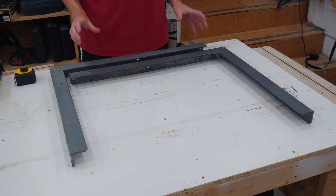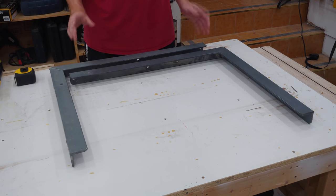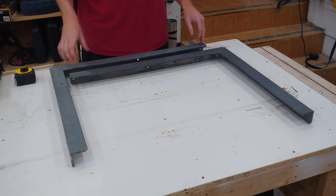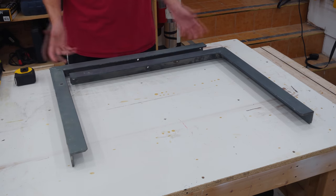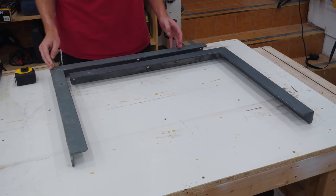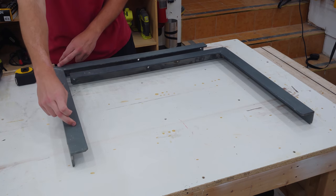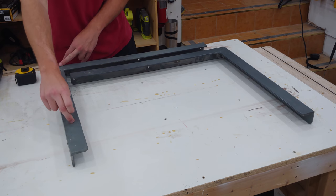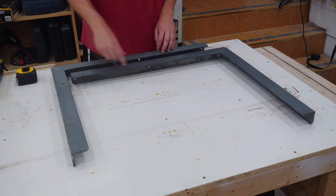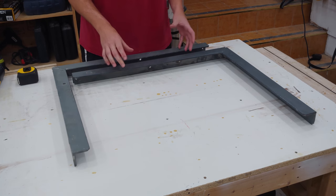So the shelf portion of this build is done. I've got it inside. 3 coats polyurethane are on it and dried. It's looking really good. Now what I've got here is two basically really big L brackets made out of some 2-inch angle iron. I found these in the scrap bin, so I'm gonna use them because they're free. So all I need to do is use my little cutoff wheel here and cut these down to the right width, a little bit under the 21 inches of the width of the shelf, and then find the height for the distance from the bottom of the shelf to the ground. This needs to allow for clearance for the totes to slide underneath and not hit this. So I basically took the measurement of the tote, increased it by the 2-inch width and another 1/2 inch. So that leaves us around 18 inches.